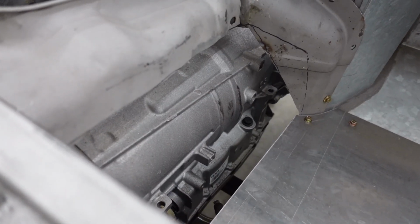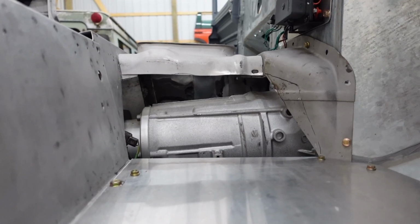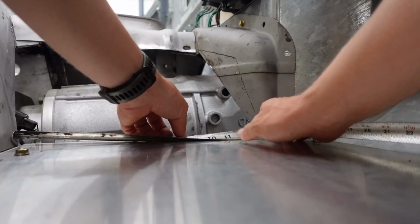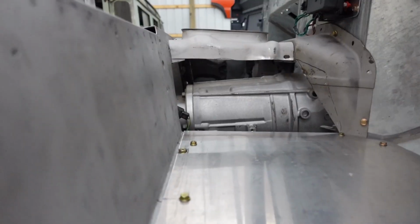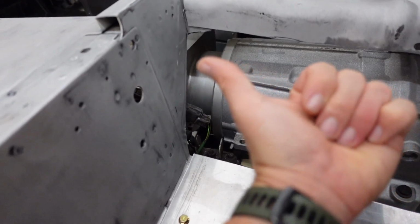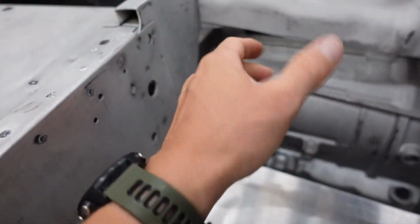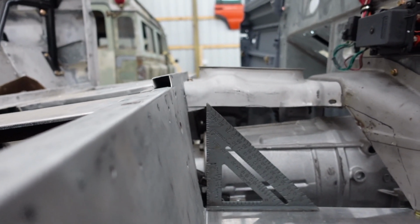This is the side that needs a little more bump out. So I'm probably gonna work my way up. Start with that bottom flange. That guy's gonna be roughly 13.5 inches long. And if you take a peek at it from this angle, the seat box has a little bit of a layback. So going up on the aluminum, we're gonna have to grow this way when we get up to the back here. Somewhere in the neighborhood of 1.5 inches.